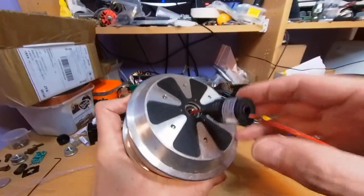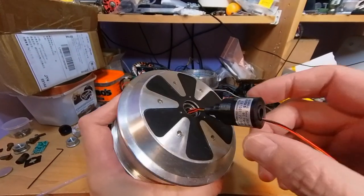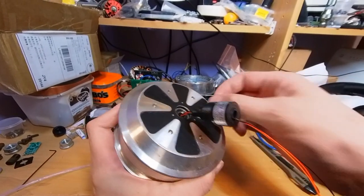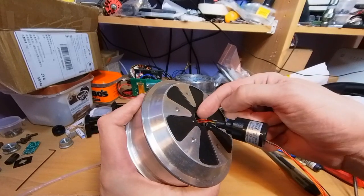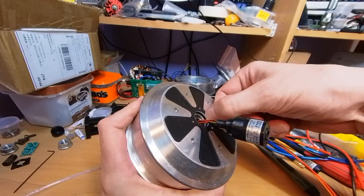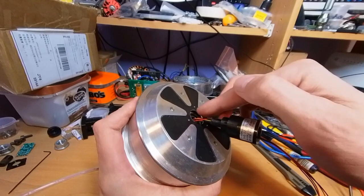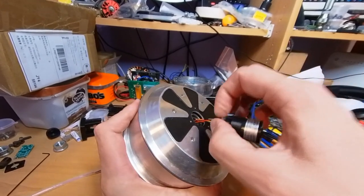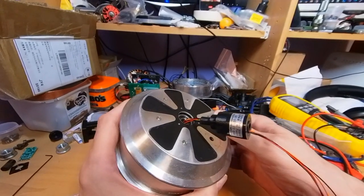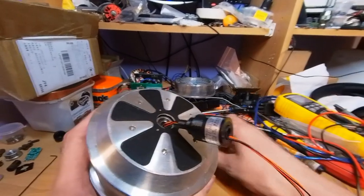In the front of the wheel I've drilled a hole. I was going to recess the whole encoder like a flush mount, but I don't have a 24 millimeter drill bit, so I've made the encoder stick out a bit further. That's only a 20 millimeter hole, but the shaft is the same diameter — if you drilled a 16 millimeter hole that would fit through. These three holes are drilled 1.5 millimeter and then tapped M2 for this.